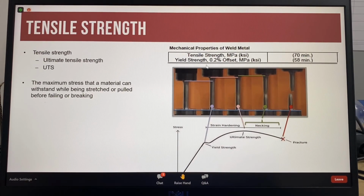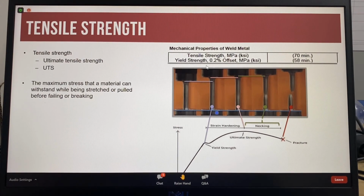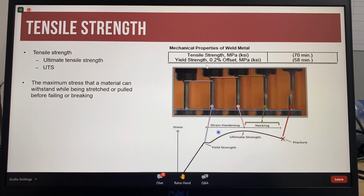These are screen captures from the Tensile Test movie that explains what happens during the tension test. The first picture is the unstressed test specimen. The second picture shows the yield strength has been reached. There is a slight drop in the stress as the material starts to stretch. At this point, the material is no longer elastic and is plastic or permanently deforming.